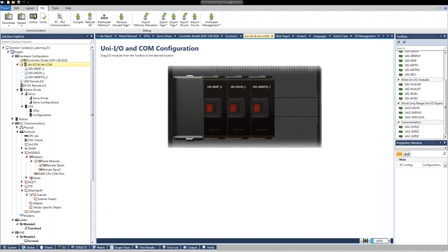But following that example through, if over the weekend you lose power, the router power cycles, they get a new IP address and nobody lets you know, you're not going to be able to see that. Now, there are creative solutions to this. You can monitor your external IP address from the UniStream and basically say, anytime your external IP address changes, send out an email with your new IP address. And then anytime you'd want to connect to that location, you would bring up that email account. You would look to see the last email you got, what your current IP is, and you could connect to that. You're effectively turning an email address into a DNS resolver.